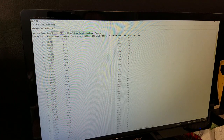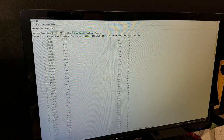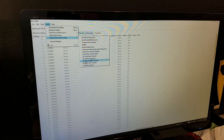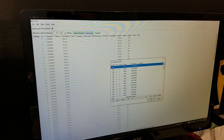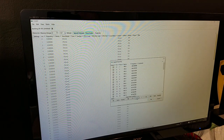We're going to go back up all the way to the top. We see zero, one, two, three, four, five, and on. What I want to do is go from the lowest frequency up. The lowest frequency is in MURS. So we're going to go to Import from Stock Configuration and run down to US FRS GMRS channels. If I just hit OK, they would start at channel one. Then when I put MURS in, MURS would be way down in the 60s or 70s — I don't want that. I want these in order by frequency. So over here I am going to adjust the location and go plus one, two, three, four, and five.